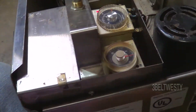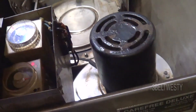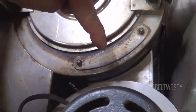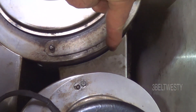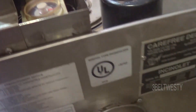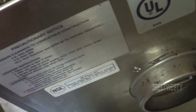I'm going to run this and just make sure this turns off. We vacuumed a lot of junk out of here. So down here where the blower is, the incinerator down there - there's some holes to this duct through here that can be vacuumed out to make sure you get good airflow. And I mentioned down in here, on the motor, the squirrel cage can get some crap off it.